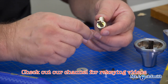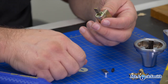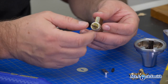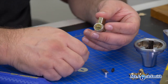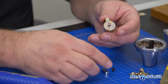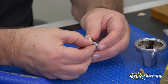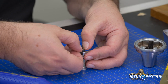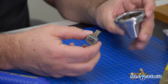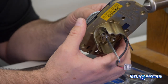The most important thing when we put this back together again is to make sure the tailpiece is horizontal — that's one of the biggest mistakes people make. Some of these you can make go the other way; some are idiot-proof and only go together one way. Make sure you put it on, then put in our spacer, our little bushing, and the little plastic piece. Make sure those are all back in, including that spacer.